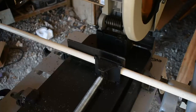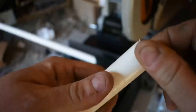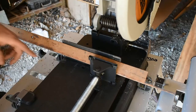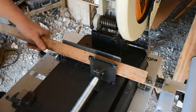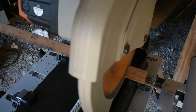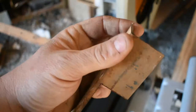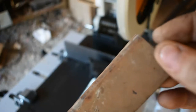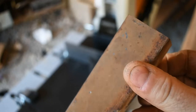I've got a piece of thin wall angle iron and we're using the supplied little bracket to hold it. I use these a lot for feathers as well as welding projects. Let's see how it handles it. Nice clean cut. If you look at this piece of angle iron, usually when you're using an abrasive saw or angle grinder you get this big blob of stuff inside that you've got to file out — it's just non-existent here. Nice and clean.